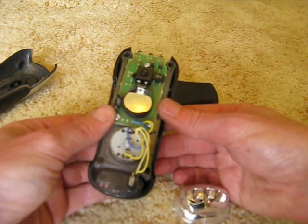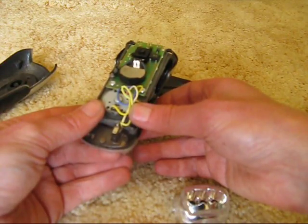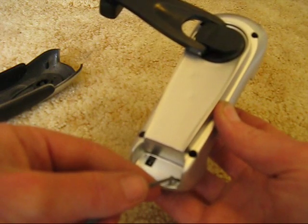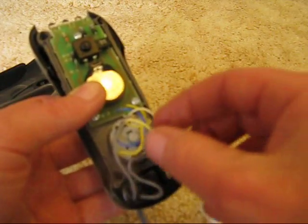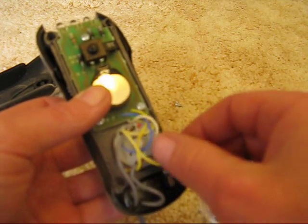There are several things I could do with it. First of all, I think it will be worthwhile to see what sort of voltage and current this generator really gives. Luckily, there are already two little holes in the box, so I use them to pass wire from the generator to outside the unit. I've also unsoldered the other connections to take the torch completely out of the circuit.